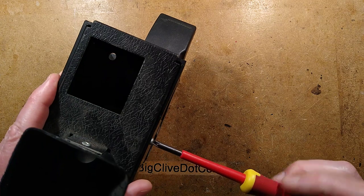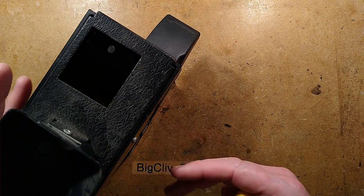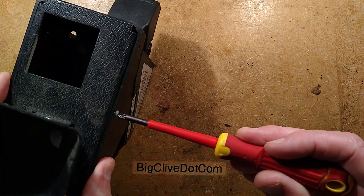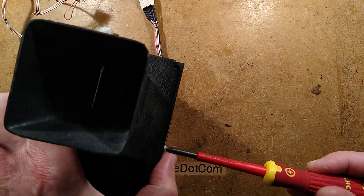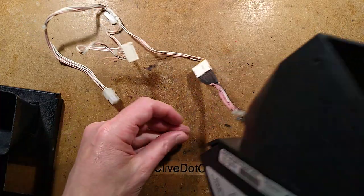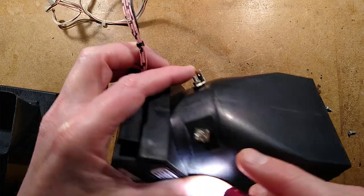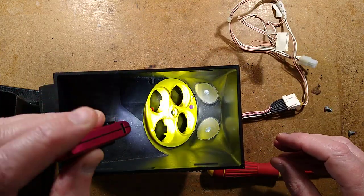I'm going to take this off first - this is where the money goes in, it funnels the money into the machine. When it detects there's enough money in it, either the money will back up into a sort of upper hopper and slide down a chute, or it can signal back that it's got enough money and divert the money elsewhere. Taking this cover off reveals the actual disc inside that rotates. There are two metal plates in there that connect to the speed terminals in the back, and when there's enough money in it, it knows it's empty if there's no electrical conductivity across those plates.